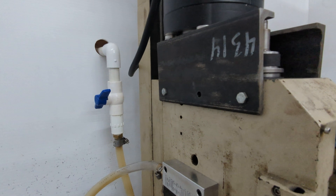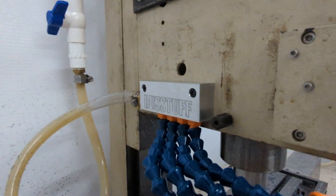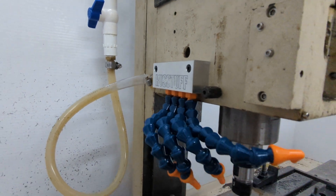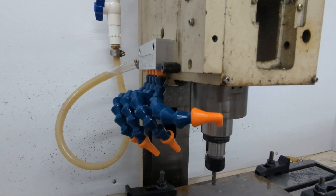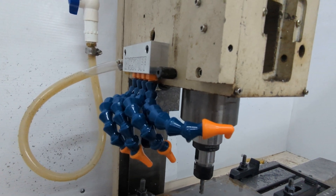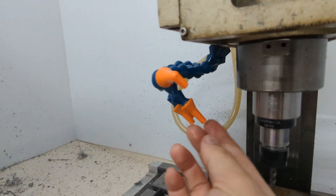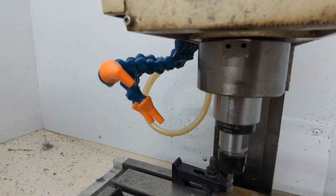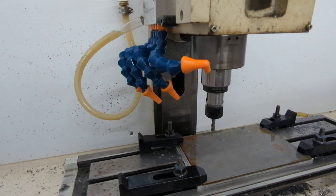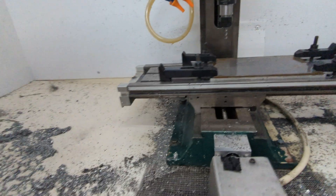Over here is the plumbing — it's just PVC again with a valve, and you can see it's not turned up all the way because it's still too much volume. That goes into a manifold I made this week — I'll roll in some footage of me making that at the end of the video. I've got four lockline nozzles; I went with four because Sam has four on his Precision Matthews and I didn't want to be outdone. I was originally running quarter-inch tips but it was too much volume, so I've gone down to an eighth-inch, and I think that's a good compromise.